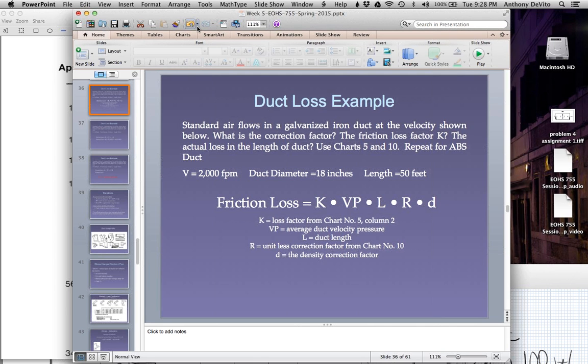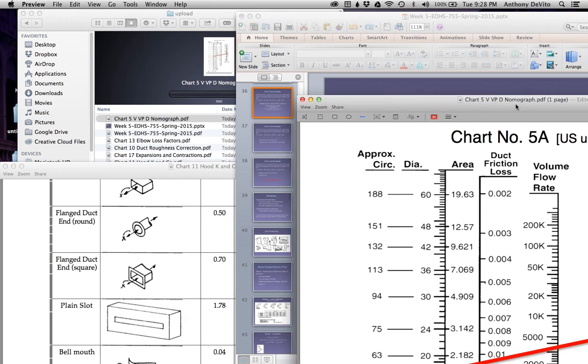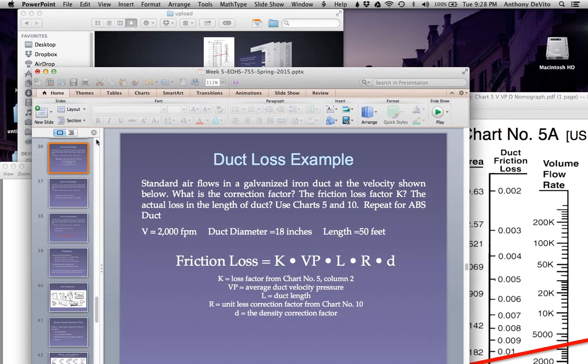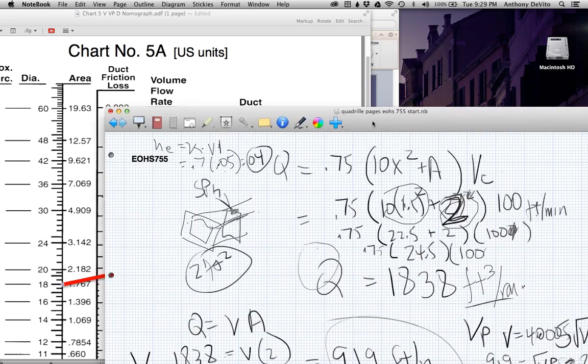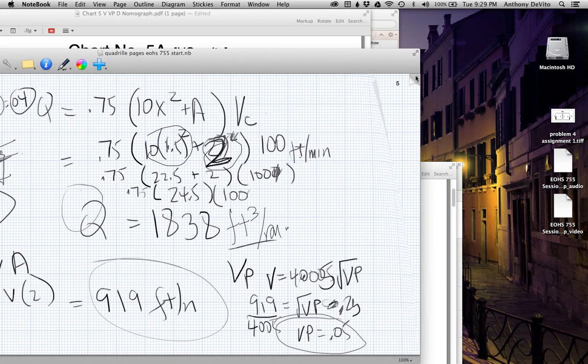So if we know what the static pressure at the back of the hood is, whatever it happens to be, now in order to keep the air moving, we have to have that much more static pressure 50 feet further up, because you would have lost 50 feet of static pressure from that point down. Does that make sense to you? Let me sketch that. What are the units for this? Inches of water.